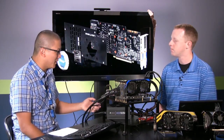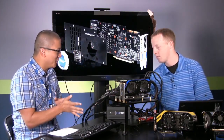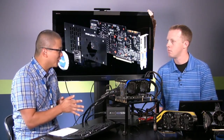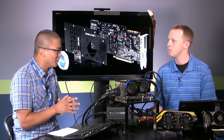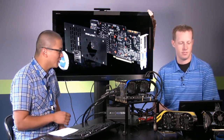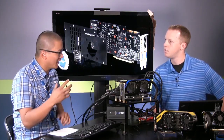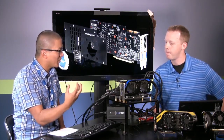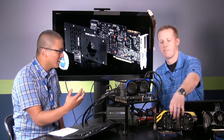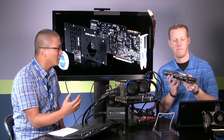If you think about a power supply, it obviously reduces the power down to what you can use for the graphics card, right? But there's nothing to clean out the power. Gotcha. There's no true filter, if you will. So the GPU reactor is meant for that. You can see it as something that cleans up the power going to the GPU itself, and it's mounted on the back of the PCB where it's physically the closest to the chip.